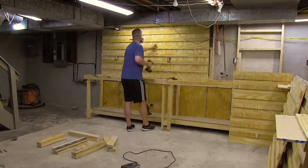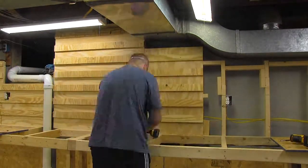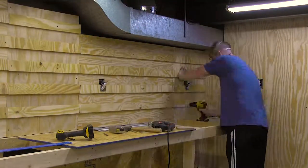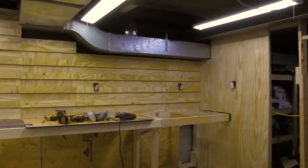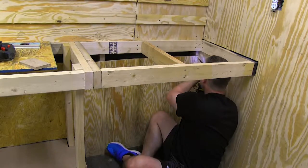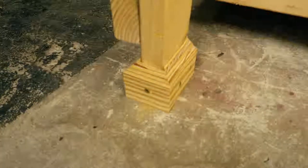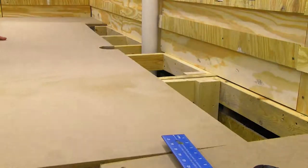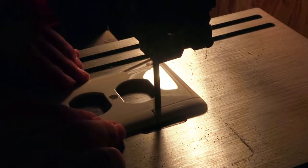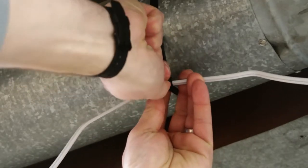Once all the panels were ready, holes for the outlets were made, and then the panels got attached to the framing. Some of the panels went on easier than others, and some framing needed to be added for a sturdier connection. A few panels got left off until Rick could come back to remove old outlets and handle a few other electrical things. Along with final touches on the electrical, there were a few other things to wrap up, like closing up other parts of the framing, finishing up the sidewall, adjustments around plumbing, making cooler looking feet for all the legs, cutting MDF to size and attaching it so the work surface would be complete, cutting some outlet covers to fit inside cleats, and rearranging the lighting cords so they'd all be lifted up and out of the way.